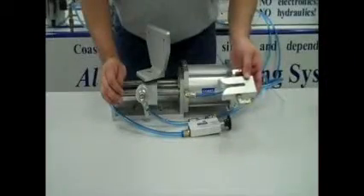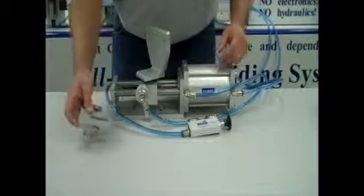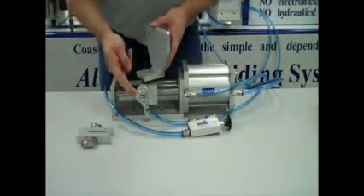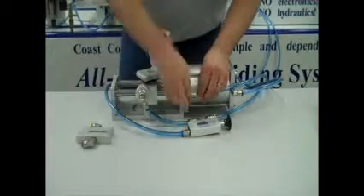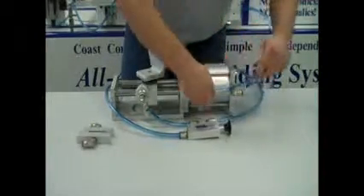If for some reason it is found that the airflow sensor reading the edge of the material needs to be on the opposite side, in order to use the auto center assembly, you'll have to rotate it so that the orifice reads this face of the carrier block and keeps a central position. You'll also have to disconnect the air hoses to reverse the flow to the cylinder.